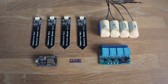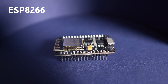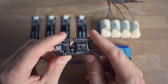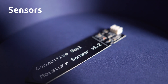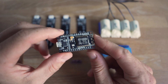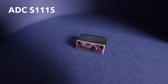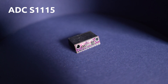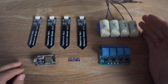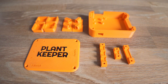These are all the components we're going to need to make the watering system. The first one is an ESP8266 — it's a microcontroller very suited for internet control projects because it has a built-in Wi-Fi module. Connected to this we're going to have four capacitive soil moisture sensors, and these are all analog. But this creates a slight problem because the ESP8266 only has one analog input. So to overcome this, we have an analog-to-digital converter which connects to the ESP via I2C, enabling four additional analog inputs. Lastly, to connect the pumps we are using a four-channel relay module.